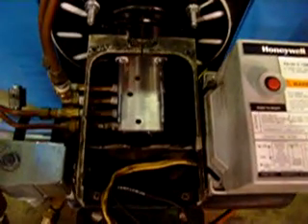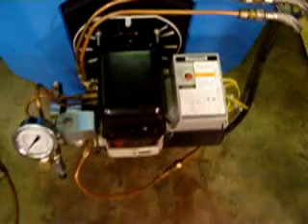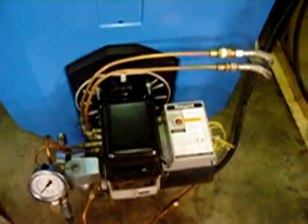The whole burner is pretty much self-contained. You can see the preheater underneath the ignition transformer. All four lines are screwed directly into the side of the block, and that makes a nice clean setup. We don't have any wires or electric preheaters in this block. Since we're not using any power for a compressor or preheaters, it's actually a little bit more efficient with electricity.